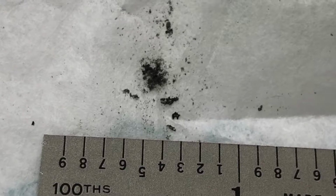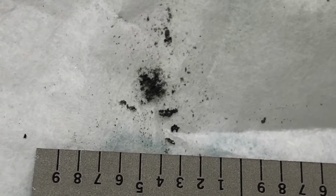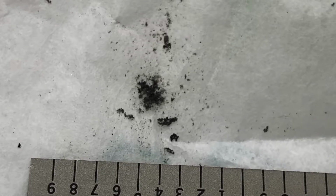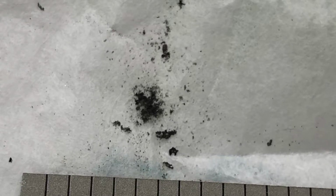And here's another good point to ponder. The debris you see here came from the new fuel lines someplace between the gascolator and the carburetors. Therefore, if you have the 5-year hose replacement performed on your aircraft, I would be checking those carburetor bowls every 2-3 hours for the first 25 hours after that maintenance had been performed, just to be looking for this indication.